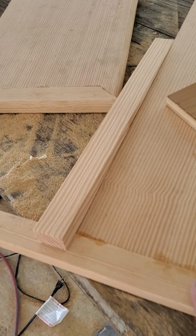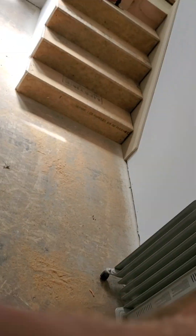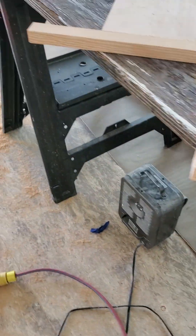I should have had some video yesterday while I was doing this — that would have been good for some guys to see. Just making it up in the field as you go. Having the right router bit and a template you can clamp down to follow — yeah. And don't try to go the full thickness of the flooring in one pass — sometimes it takes two or three passes as you extend the bit down. Anyway, I'll keep you guys posted as we start to put these together. Thanks for watching.